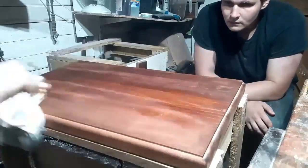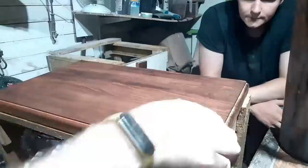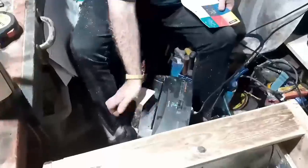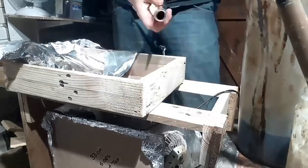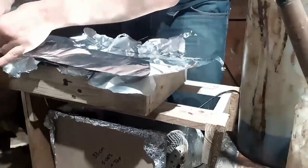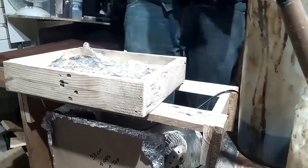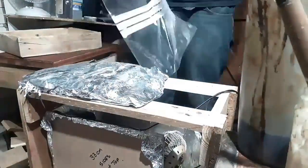When it comes to finding affordable insulation options, there are a few materials that are often considered cost effective. 1. Fiberglass insulation. Fiberglass insulation is one of the most widely used and affordable types of insulation. It is made from tiny glass fibers and is available in batts, rolls, or loose fill form. Fiberglass insulation provides good thermal resistance and is relatively easy to install. 2. Cellulose insulation. Cellulose insulation is made from recycled paper and treated with fire retardants. It is available in loose fill form and can be blown into attics or wall cavities. Cellulose insulation offers good thermal performance and is an eco-friendly option.